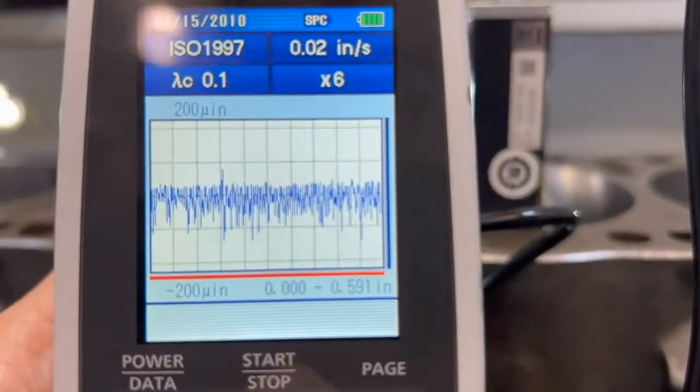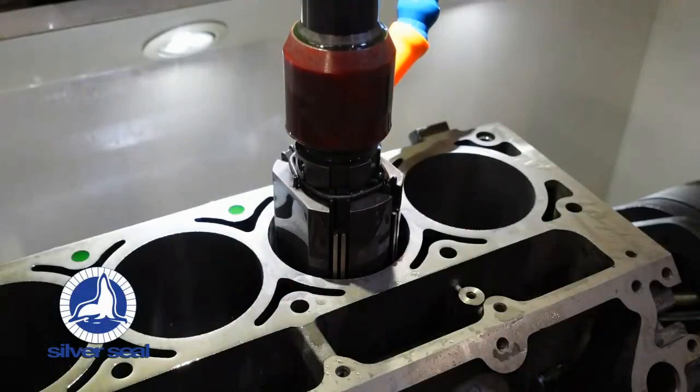Yes, sir. And you know, Ed, I was noticing something on these machines that when we go into plateau mode, which is obviously when we're trying to get the right surface finish, when we're trying to get that maximum or extreme plateau. Exactly. You'd be able to have your roughing operation and then your plateau operation. And I've noticed on these machines that when we go to that plateau operation, the stones feed out and get their pressure before the head ever starts to spin.